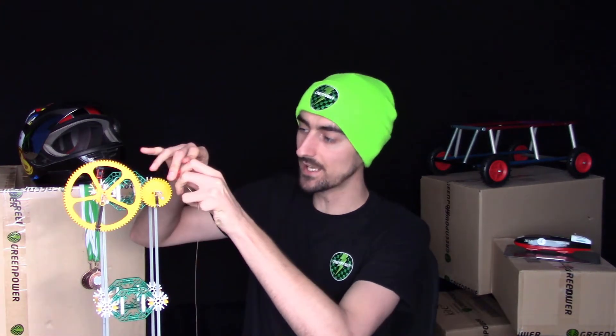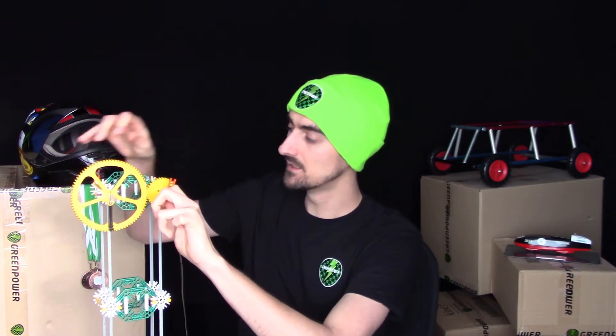If I try to lift the load using the little gear we should find that it's a lot harder to lift. So here we go rotating on the big wheel and - oh no, the handle broke - because it requires so much more input torque and I cannot deliver enough force. Because I cannot deliver enough force at the input the output will not rotate, and again this is what would happen on your car. If you have the wrong gearing setup and not enough torque you'll just sit at the starting line with the motor sounding really unhappy as it tries to get the car going. So there you have it - that is why we use gears: they help us alter the torque and speed, and the gear setup on your car has been chosen to give you a good start.